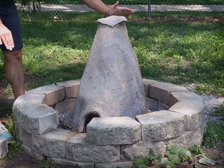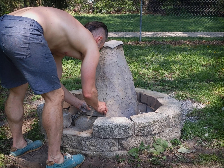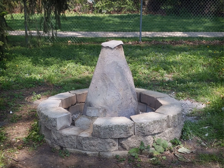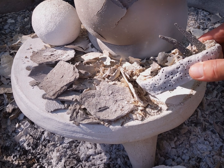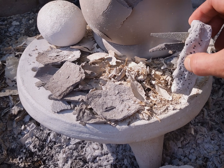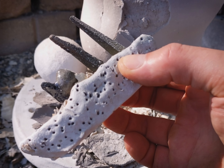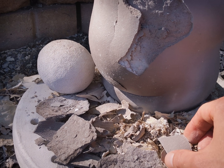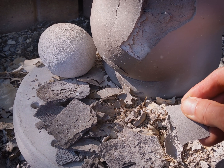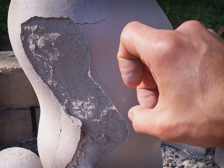I'm closing it up now. Total firing time was only about three hours. So how did it go? The bisque geese survived fine. The perforated cone pack, which was green paper clay, is also fine. I'm guessing it got to about 1700 Fahrenheit. The large paper clay piece suffered a good deal of damage, and the top is just barely sintered, indicating that the kiln temperature was uneven top to bottom.